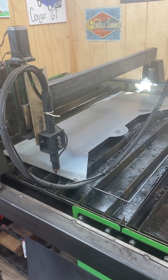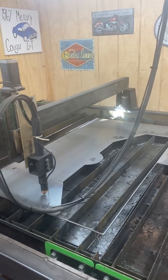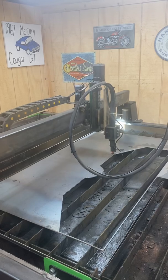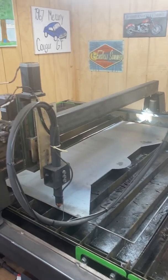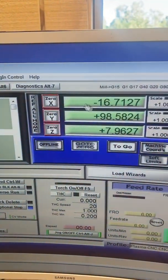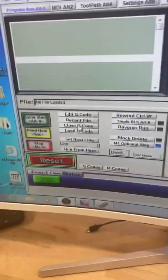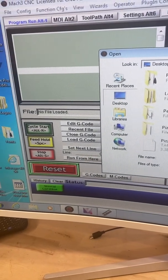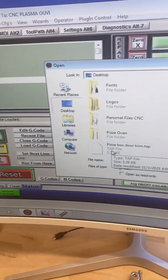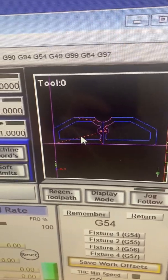That's close enough for me. When I have cuts that go across the table like that, I'll usually run the torch to make sure it's not going to run off the metal — that looks pretty good. So that's my zero-zero. I come back to Mach 3 and hit zero-zero. Then I'm going to import my G-code: Load G-Code, scroll down to find the file you're working on. I keep mine on the desktop until I'm done, then put it in a project folder. I open it and it imports the G-code right there — you can see your little image and right-click to move it around.